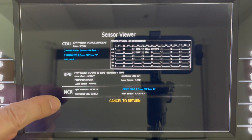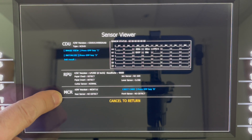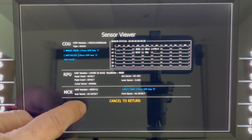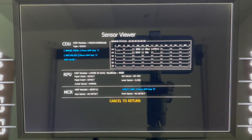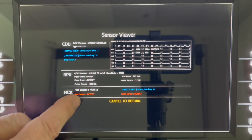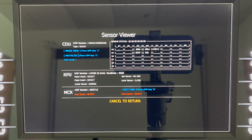Finally, there's a card reader section of this test. It will list the current firmware version in the card reader, and there are only two sensors. The card reader has a sensor when you insert the card and one when the card reaches the back of the reader. If you insert your card, you'll see both sensors turn red indicating the card is installed, and it will latch onto the card. Press zero on the keypad to release the card. As the card comes out, you'll see both sensors turn gray, showing those sensors are operating properly.